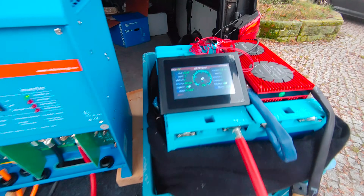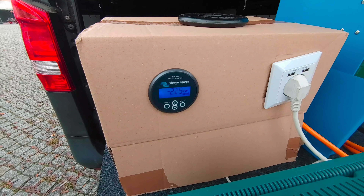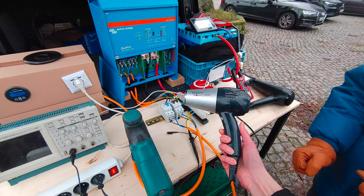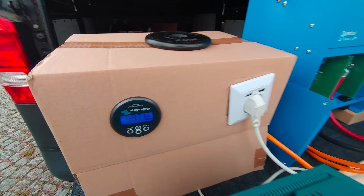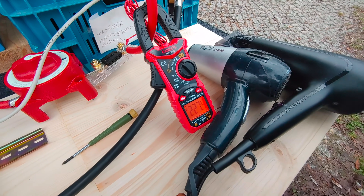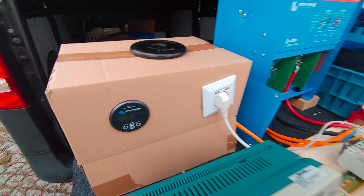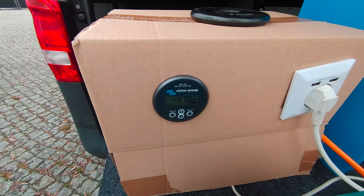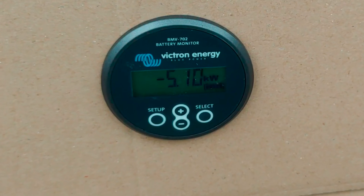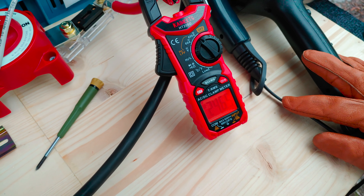The BMS shows a similar value, although not so accurately. On the battery monitor we read 2.2 kilowatts. With the second dryer running, the power consumption goes up to 4.7 kilowatts and we're drawing almost 230 amps on the DC side. Next we start the jigsaw at the lowest level, which brings us just shy of 5000 watts. As we crank up the speed on the jigsaw, the power draw goes up to 5.1 kilowatts and the current is almost at 250 amps.